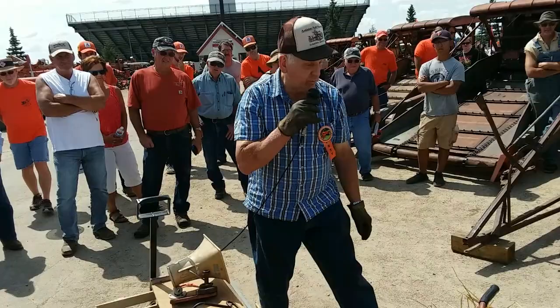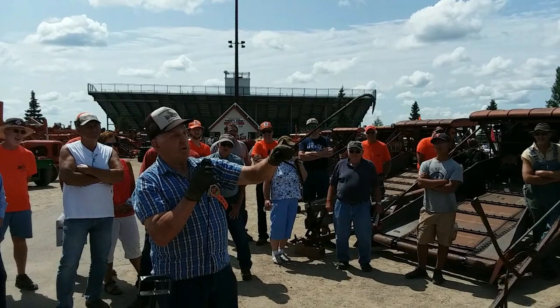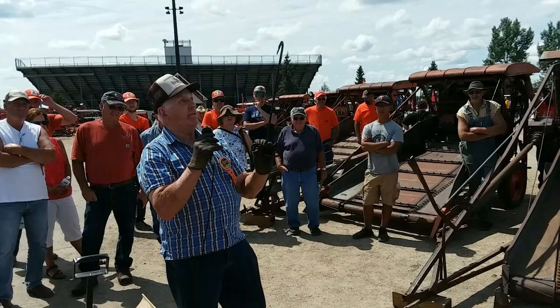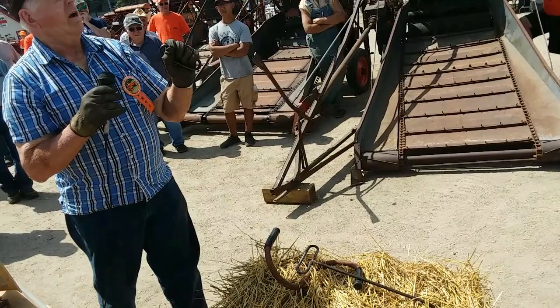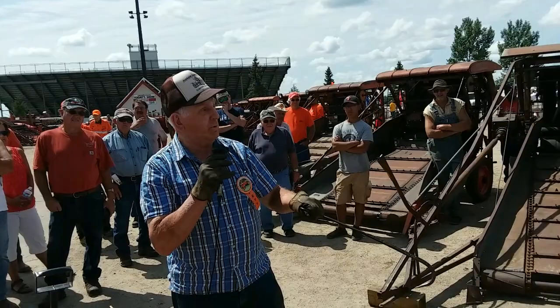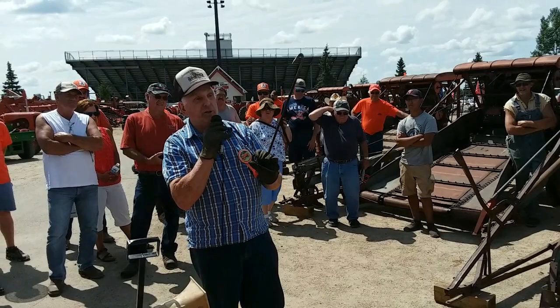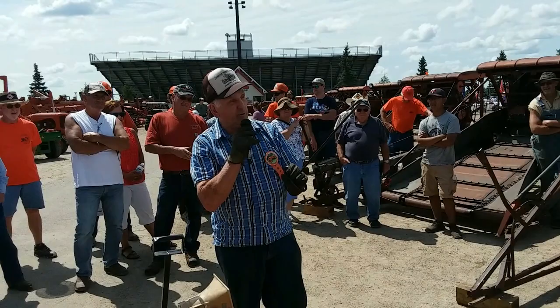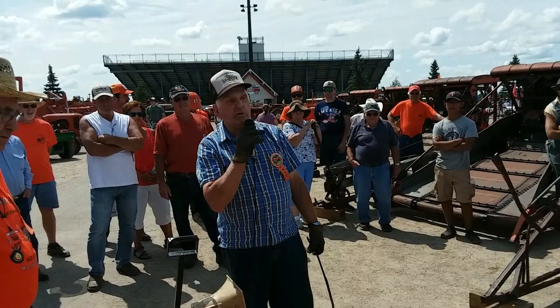Frank came home with the idea. I think this bale hook here is one of his originals. If you look at it closely, you'll notice two things. It's got an open handle like this, so you put two fingers on both sides — you can pry that bale out of the hook. The other thing is it's got a fairly long, straight hook on it. That makes it easier to pull out when you hook it in the bale. When you want it out, you can either twist or hook it up. On a hook this long, you didn't have much twist, but if you just push it, it would naturally come out. That was a bit of a refinement we worked on later. You made it out of three-eighths soft stock and it wouldn't take it, especially the year that the bales froze in the field. They were picking them out of frozen dirt and they straightened it out. So you added a bit of reinforcement — just a couple of electrodes tacked on. Later on, we used high-tension steel. Potato chain worked great, and that's what these are made of.